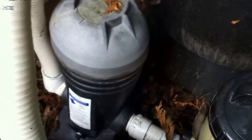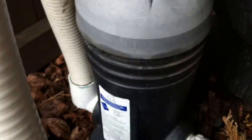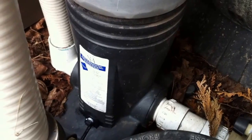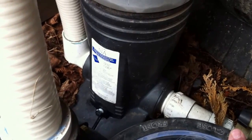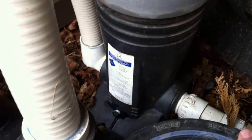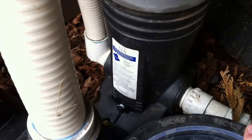Back out of the filter, we're going into a Nature 2 colloidal silver injection system. Colloidal silver is a bactericide — it naturally kills bacteria and reduces your chlorine demand. These systems require a new mineral pack once a year, dumping silver into your water which kills bacteria but also absorbs into your skin every time you're in the water. I personally don't use these, even though they technically work, because the jury is still out on the potential harmful long-term effects of silver exposure — the body doesn't really dissipate the metals it absorbs, it just continues to add up over time.